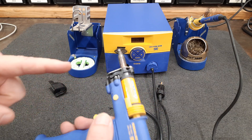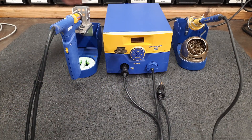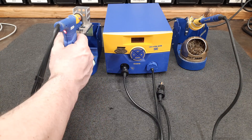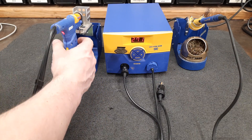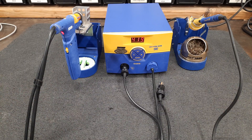The gun — you don't get the nozzle; this is my nozzle from my other unit. I will power this up. When it beeps, it's at temperature. You can't activate the pneumatics until it beeps, so you have to be at temperature. It prevents clogging.